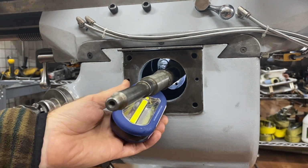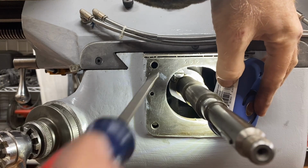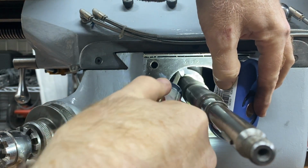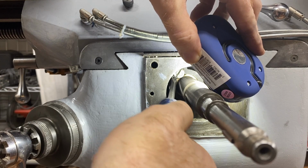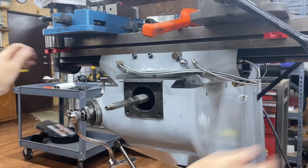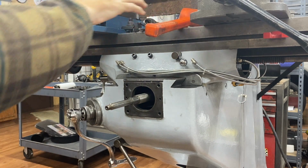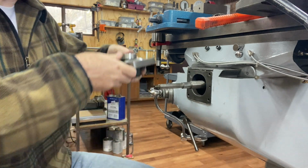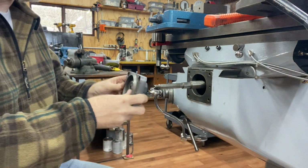You can see that I've taken off this front bearing housing. Okay, so there, I'm gonna tighten that up. And then I tighten up the tensioning screw there. Okay, we'll slide that. That's gotta be back enough that those plates can be there. Then, this bearing housing, I'm gonna push these bearings back in. I just tap those back in.